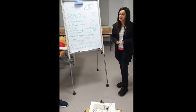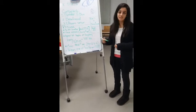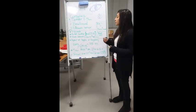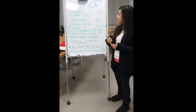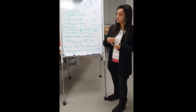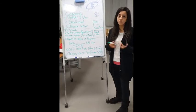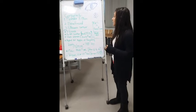This is Mirette Ehab. Now I'm going to explain how we use the distance that Ammar got for us to generate the sound. First of all, I have to let you know that we use 2 different sounds for each range. From distance 0 from the sensor until 20 centimeters, it uses a specific sound, and from 20 centimeters until 100 centimeters, it uses a different sound. This helps the blind person know the difference between the locations and positions of the objects ahead of him.